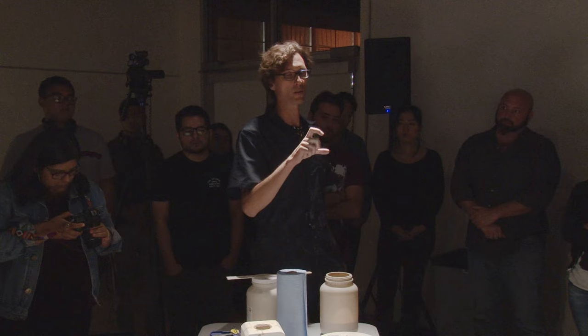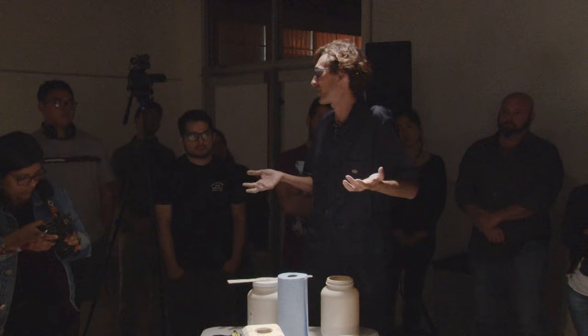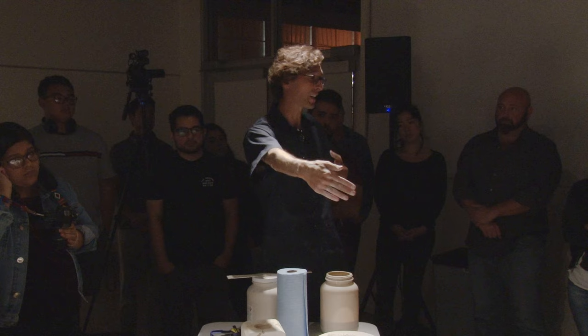Let's say there are some innovative techniques here, not necessarily slip casting, right? That's been around for hundreds of years. But the desire to use it in different ways and to also input digital technology into it, could that scale up to something much larger, right? There are a couple pretty significant limitations, right? Number one, the size of your kiln. The biggest thing I can make is basically the biggest thing that can fit in a kiln, right? So if I only have a kiln this big, that's as big as the largest component I can produce would be, right?